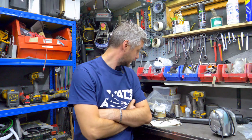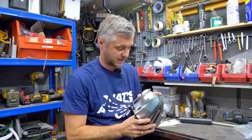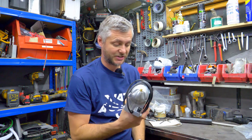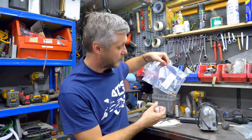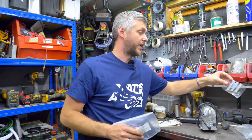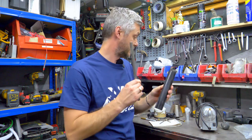After browsing online for different techniques and ideas, I found a few different tutorials on how to make a homemade engraver. So, what will you need? A compressor. Some people use tire pumps and they modify them. I have this old airbrush compressor. Essentially, they're the same thing. So we're going to modify this. This is going to be our air supply. Then we have a few little parts to make our engraver itself, some chisel set and everything. And then we have some metal for the handle, for the pin, put a little spring in it, and hopefully I can engrave something. So let's get started.